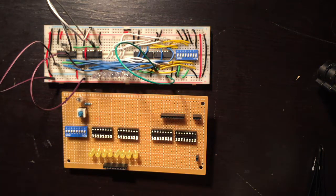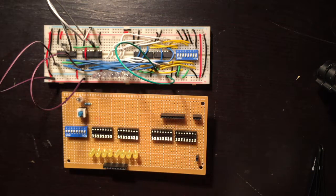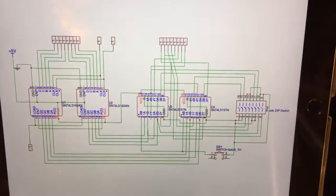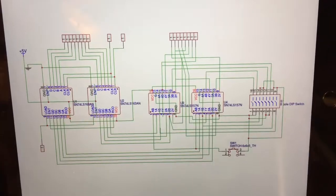But because I'm doing this the way I want to do it, I'm going to actually make this a two-sided plane. So I'm going to use the top and the bottom. But I'm going to keep the top focused on aesthetics if I can. So silver copper wire, straight lines, no windy, no crossing, just nice clean lines. So for anything in this description that seems pretty clean, I think I'm going to do it on the top, and all the dirty stuff I'll do on the bottom.